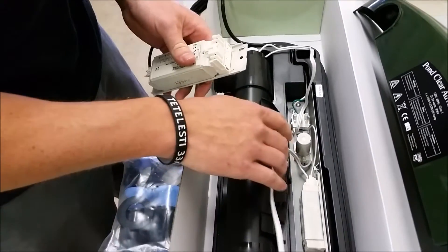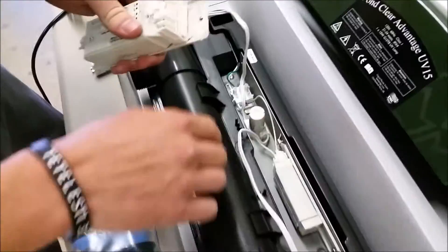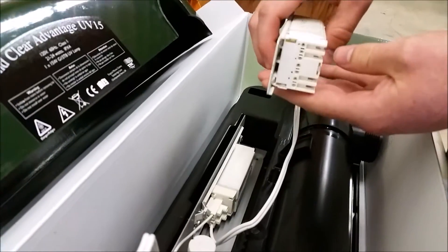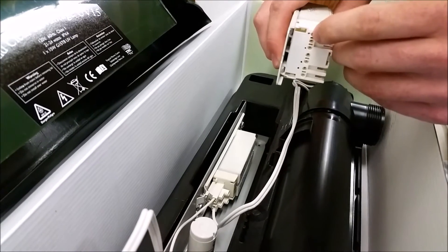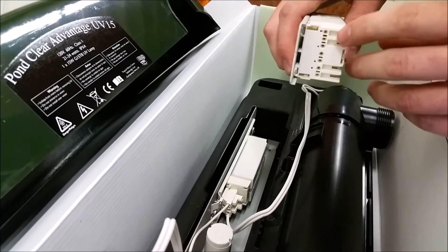In order to do this, you have to rewire. These wires will be the same from the right side bulb. Given that the ballast sits in there like this, the top mark will be where the right side wire goes in. The other side will go into the starter.